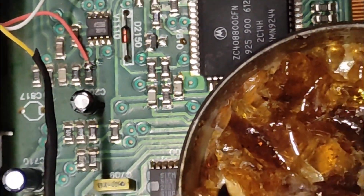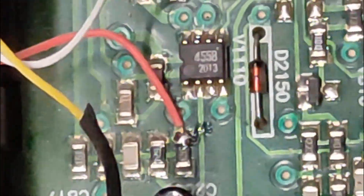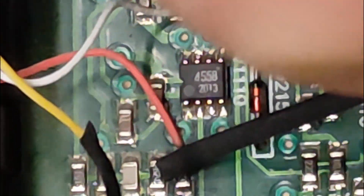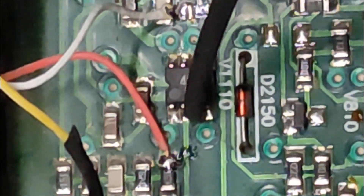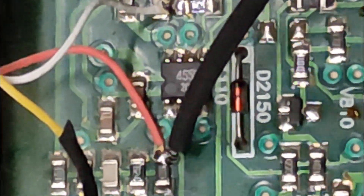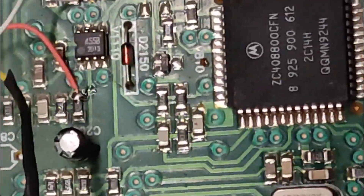I got it all wired up now. Pin 1 is connecting to these two — I think they're capacitors or resistors; it's zero ohms resistance. I think it's the right side. Pin 1 and pin 7 — that's a capacitor and that's a resistor — I connected it here. And a ground wire coming from the blue wire as a common ground.